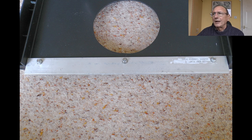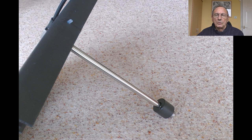I took a strip of aluminium, drilled some holes in it, and bolted it to the lid so it doesn't sag. I also wanted to measure the nutrient level in the tank from Home Assistant on my phone, so I fitted a level switch — the type used on RVs — that varies in resistance from zero to 190 ohms in steps, using a series of reed switches switching various resistors, depending on the height of the float.